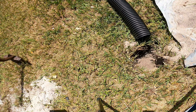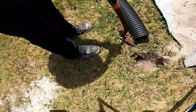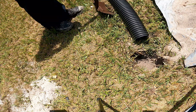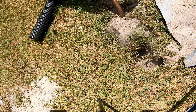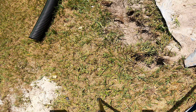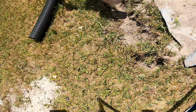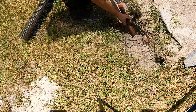Next, we'll go ahead and lay out the downspout drain. We're using four inch corrugated pipe. You could use PVC — it works just the same. Go ahead and cut off some sod so you've got a good straight line to install your pipe, and we're ready to dig this out. This trench will go all the way back to your downspout. We're going to go ahead and clean the trench and we'll lay some pipe. This four inch pipe will connect to your downspout, come out here to the vertical drain, connect to the T that we're going to put down here, and it will drain just like daylight.